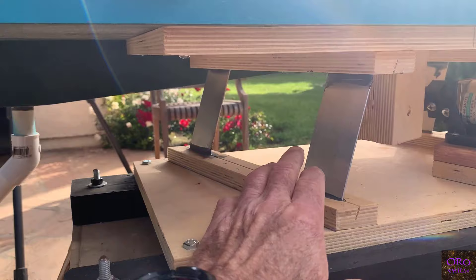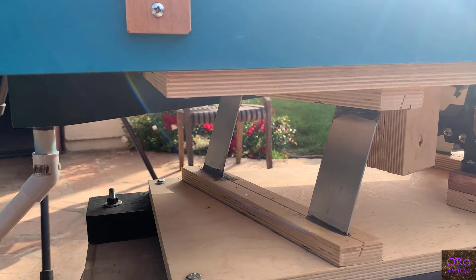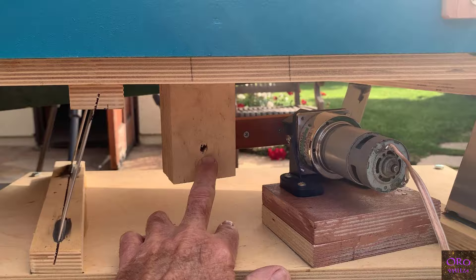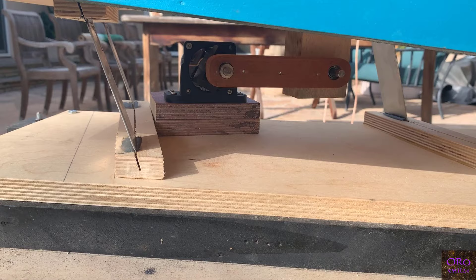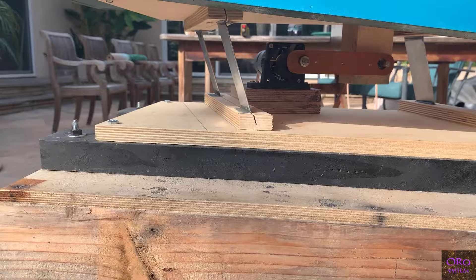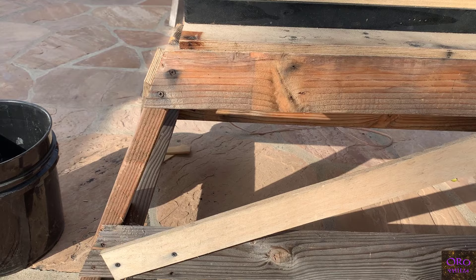The table shakes via a mechanical stage. There's a top board and a bottom board, and the top board is supported by four pieces of 6061-T6 aluminum flat bar stock, one sixteenth of an inch thick. A motor moves the table through an arm that couples an eccentric motor coupler to the top of the table. You can see the motor, the eccentric mechanism, and the arm coupling on the other side of the motion stage. The base has to be sturdy because the shaking motion will shake the bejeebers out of it if it's not well constructed.